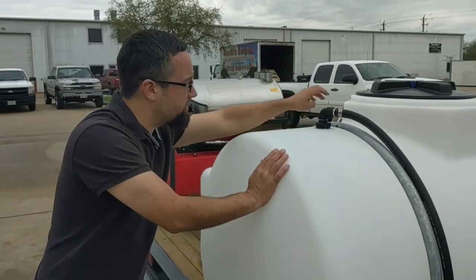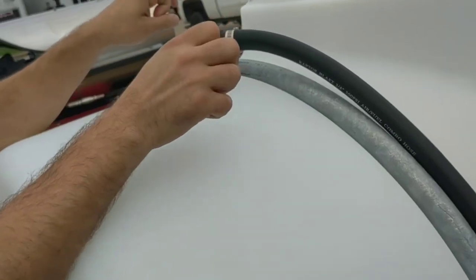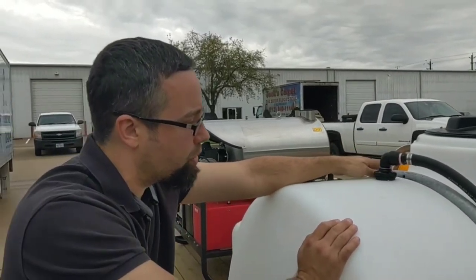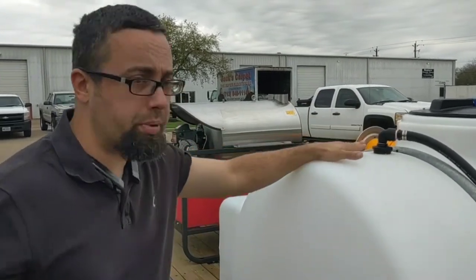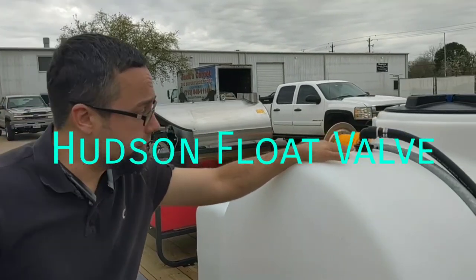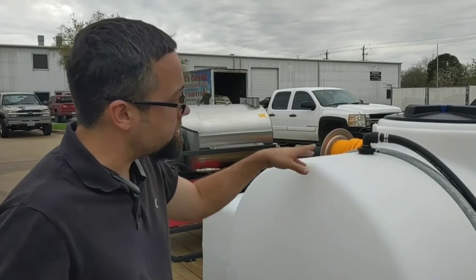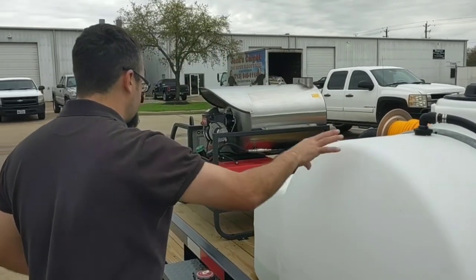We use galvanized straps on these larger tanks. We're not big on nylon straps — whenever you have this much water in there, we like something more durable. Some people consider it overkill; we consider it precautionary. They're galvanized straps that are bolted on, so it keeps it rigid. We also put on a one-inch Hudson float valve, so no additional water can exceed the tank height and spill out. In the city of Houston, that can be a city ordinance violation, and it's also just a waste of water.